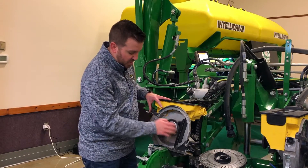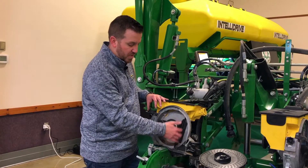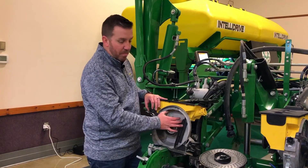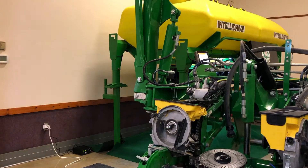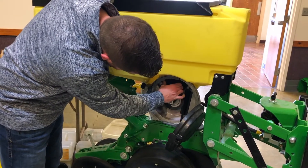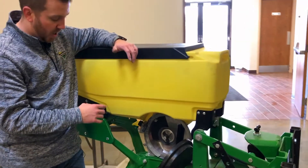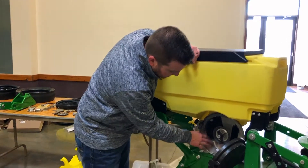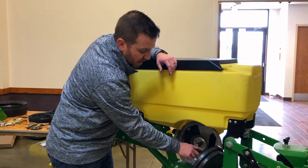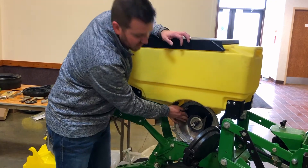Another inspection point is to make sure all the brushes are in good order and shape. Make sure no rodents have gotten in and caused any damage. The brush in the back is what prevents seed from falling back into the system, so it needs to be in good shape. On older row units there will be a baffle system - push the clip in and slide the baffle up or down. You want the baffle in the down position for smaller grains to limit the amount of seed entering the meter. Keep it in the up position for corn and soybeans, down for smaller grains.